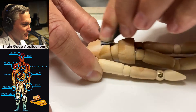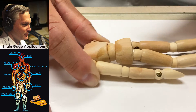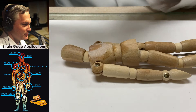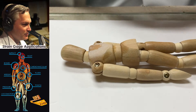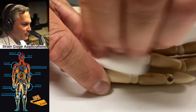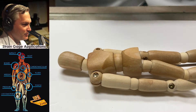All you're trying to do here is lift off any contamination, make sure the surface is relatively smooth but yet has some texture so the adhesive can bite to it. Once I've done that, I like to go ahead and clean one more time using the isopropyl alcohol. I'll take another gauze pad, fold it, put a little bit in, and use a couple of wipes off the backside to clean any little dust particles off.